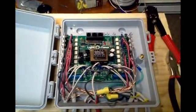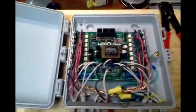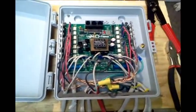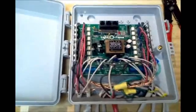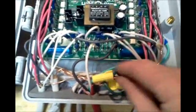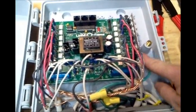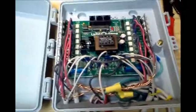Here is the finished wiring project to the card. You'll see that I have added the power cord right here. The power cord is actually a 12-gauge wire — a 12-gauge extension cord I got for really cheap at Lowe's, probably 75% off the regular price. I use those exclusively for my controllers. I got it in a 100-foot segment and cut off the female end, saving enough to solder onto something else if I want to. I've taken all the grounds from the right part of the card and wired them together, and all my grounds are grounded to the box right here. Then I have the left grounds, wire-nutted together with their own separate ground wire. So there are three ground wires — the third one coming from the outlet.